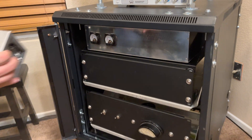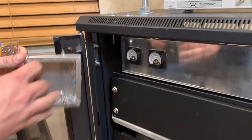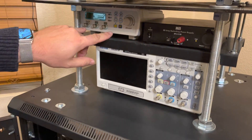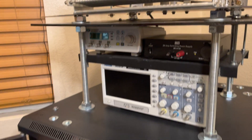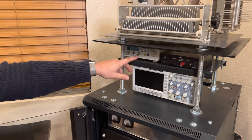This VFO is going to sit right on the side here. Also incorporated into this transmitter is the actual VFO — got it off eBay. It's a regular Chinese DDS VFO. You set it for twice the operating frequency, put it into the duty cycle adjuster, and you're off and running.